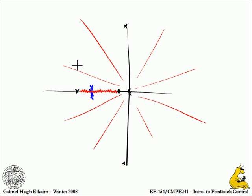So the problem is all of these guys are going to end up on one of the asymptotes, and so I have to be very careful when I do this. This is going to mean that I'm going to have a very narrow region of this. While it works to attenuate these guys, it's screwing around with what happens at DC. How do you explain that intuitively? Well, I explain it with the frequency argument, which is that adding these guys is pumping up my gain and removing phase that I need for stability. So we look at the top, we look at the bottom, and this part in between where it runs down gives me a stability argument, the slope of this. By doing this, I'm altering the slope rather drastically, which is altering my stability.